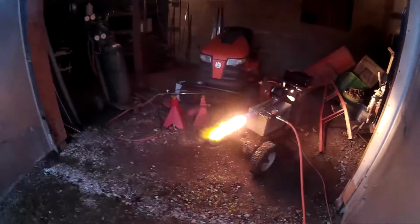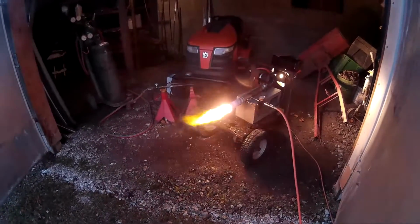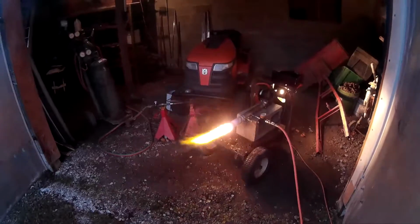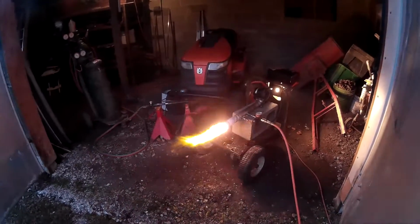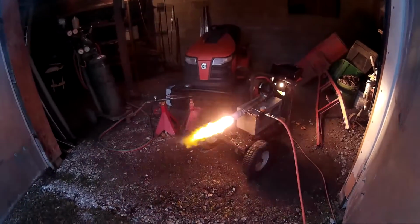It doesn't smell super bad, but I'm learning as I go along here, and I'm thinking that if I actually had the furnace built and that was blowing inside of a furnace where it was heating up refractory and crucible, and then had a lid on the top of it with just a small hole in the center, I think a lot of this smoke and vapor that I see floating around here now would probably be vaporized and burn more completely. Even better yet, if it was in a furnace, which is where I intend for it to be anyhow.